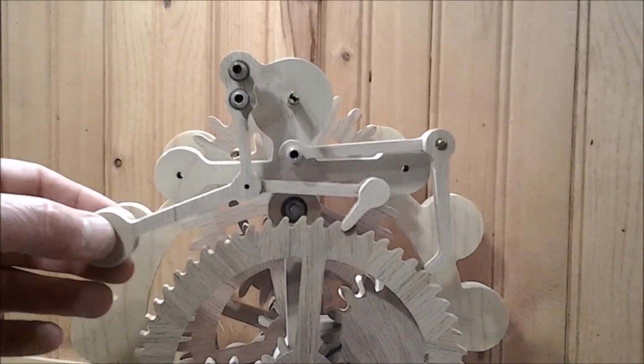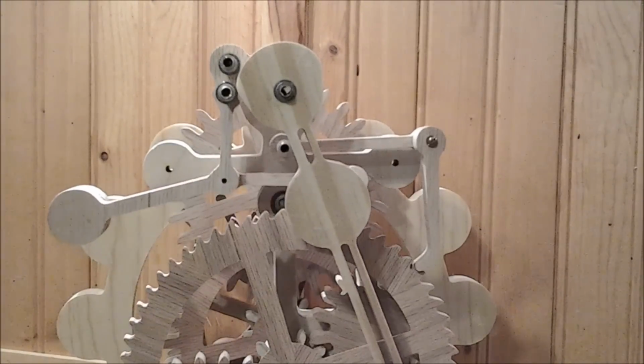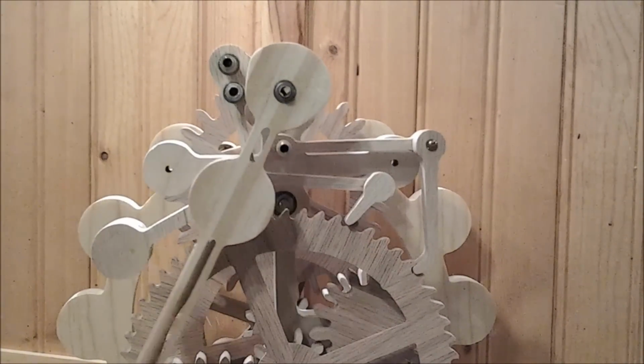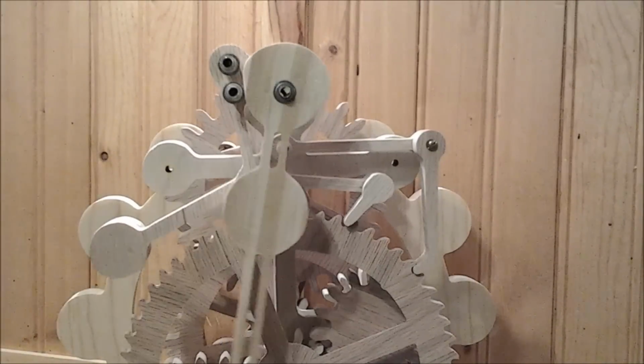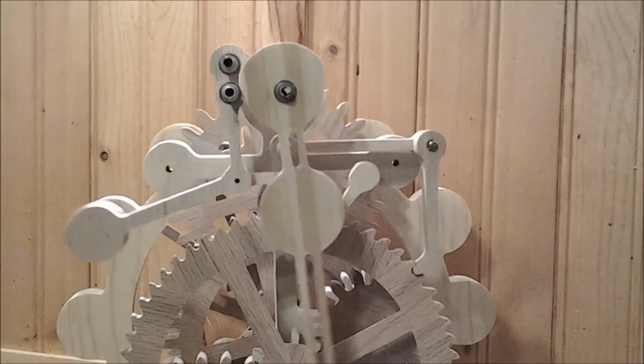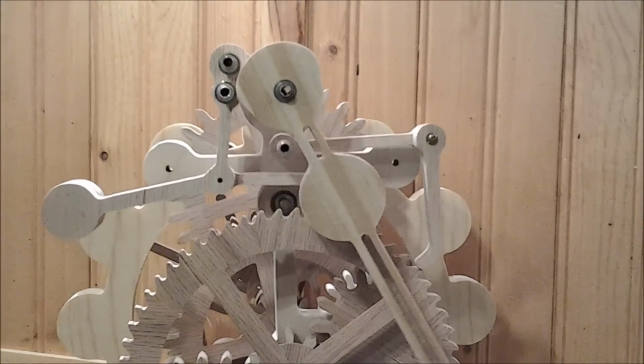the clock mechanism. A cam on the pendulum is used to limit the amount of travel of the moving pawl so that the mechanism will operate reliably even if the pendulum swing varies. You can see that even with large swings of the pendulum, the moving pawl moves only a fixed amount.